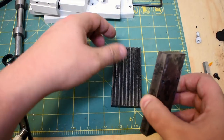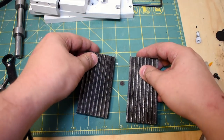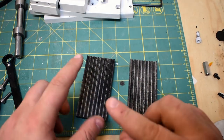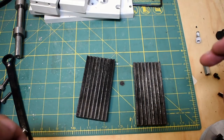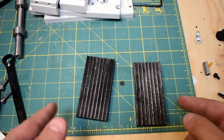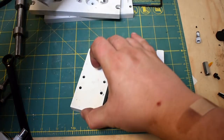Now, the jaws are designed so that when they line up, they interweave like this. And it's actually really interesting. I think what it's supposed to do is put three points of force going through the rock, and it makes a shear plane and breaks it like that. Some people were asking why it's not stippled, or the grooves don't go the other way, and I think it's just so you still get that force concentration, but the material still flows fairly freely down the middle.